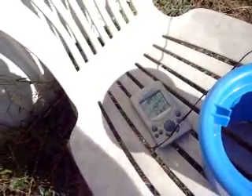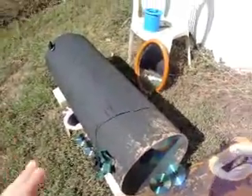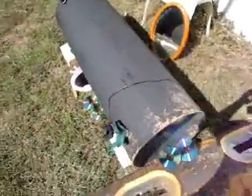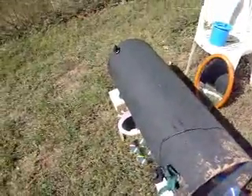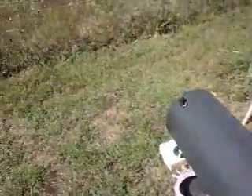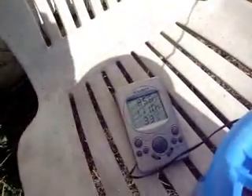I'm averaging about 25 degrees above ambient temperature. The box I'm going to build will help retain that heat even more. I set this thing down about 20 minutes ago, put my temperature gauge on the inside, and in 20 minutes I've gotten that kind of reading — and that's with wind blowing across it and pulling some heat away. I'm going to build a nicely insulated box with a glass top; I've got some fiberglass I'm hoping to clean up and get really clear to use as the lid. We're up to 111 degrees now and 85.6 outside, so it just keeps going.